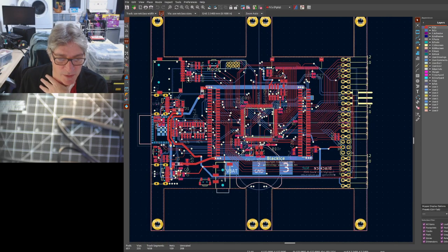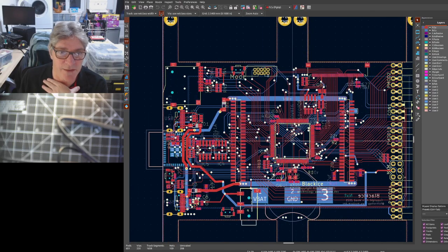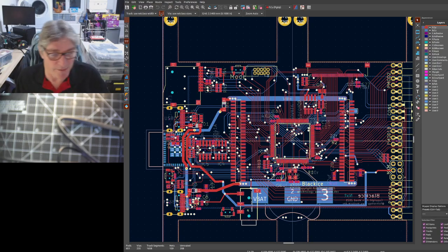The other thing, I've taken away one of the jacks because I'm using one of the TX ports to talk directly between the STM32 and the ESP32. There's another pin here which is to do with programming the ESP32, so I can boot it up in its programming mode. And the USB from the ESP32C3 goes to the power delivery USB, so you can use that. But you only need that really when you're programming it. Otherwise, everything can be done either over Bluetooth, because if you're running CircuitPython, it supports Bluetooth transfer, or you can talk to it via the virtual COM port as well.